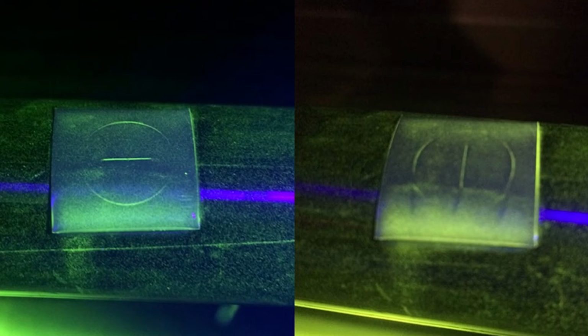So the picture we have here is of QQIs on the same part, and as you can see, the indications visible are in opposite directions. So this would show an example of when you mag it with a headshot and then you inspect and then you pull in your auxiliary coil and mag it again.